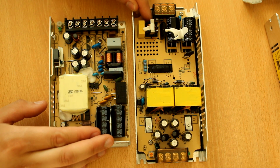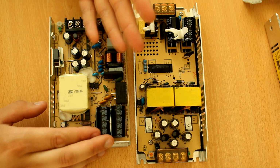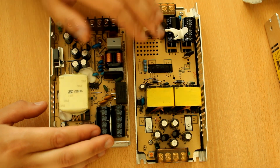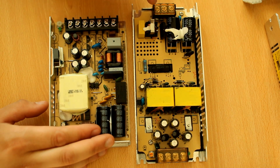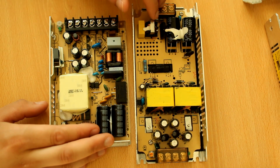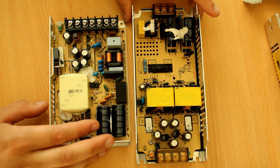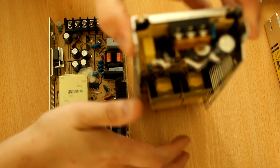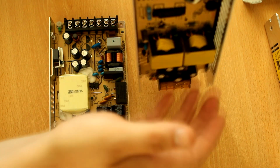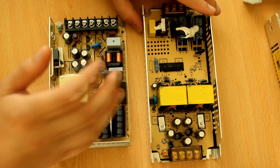And these fuses, they don't just fail, they can fail explosively in the worst kind of situation. Not necessarily always, but they can. That causes damage, and that causes collateral damage. You don't want that to happen. You don't want the flaming embers of a fuse running amok through the rest of your stuff. These are open frame power supplies. They are not contained. So if this is vertical on a wall, the fuse breaks and spills material all the way down onto, for instance, other electrical equipment. That could be a problem.